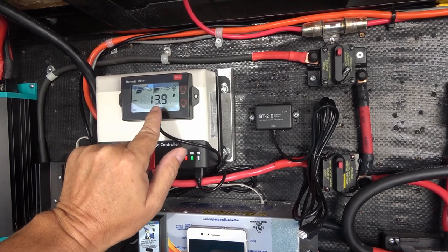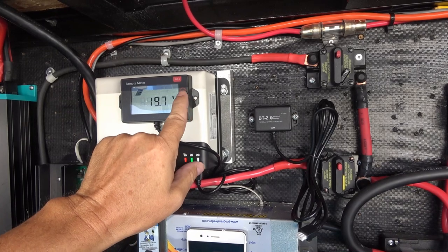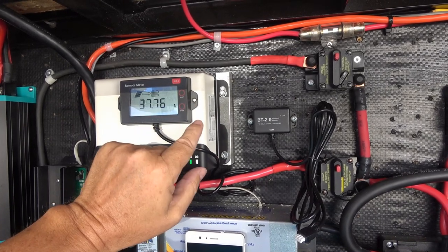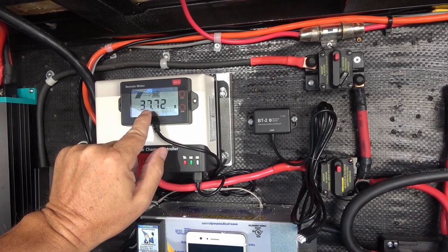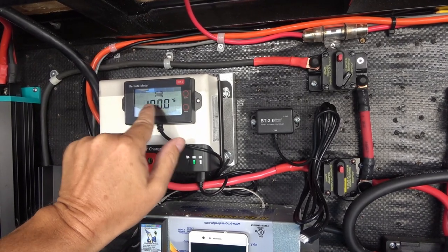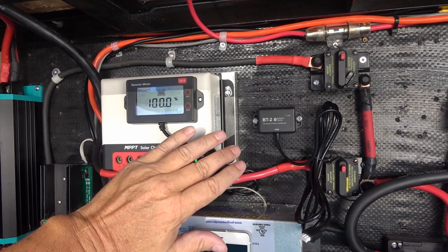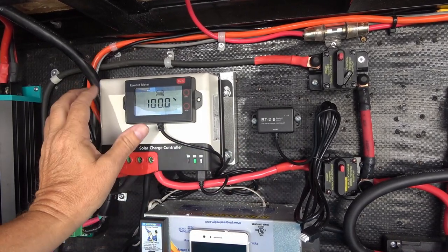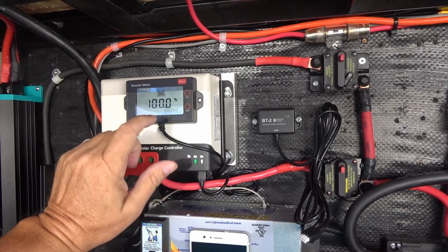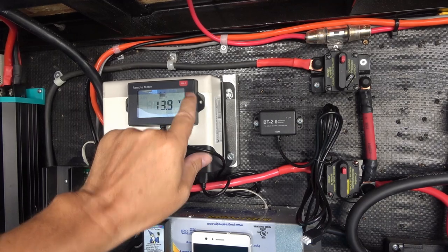You can see here right now it's fairly sunny out — 13.9 volts, 19 volts into the controller, and we're putting out 37.9 amps, so almost full amperage there. My battery says 100% but it's not, because it's in lithium mode. I have lithium batteries and I think this thing is just set up to look at lead acid voltages, so it can't deal with lithium as far as that goes.